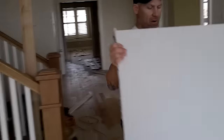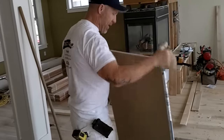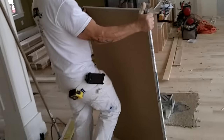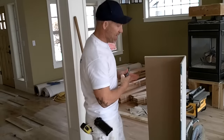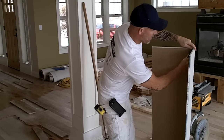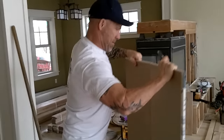Then you're just going to take that piece of drywall, move it around — I'm going to hold both sides and take my knee and put some pressure where that score was. Just hold it and it's going to snap the gypsum inside. Now I'm just going to take and cut the paper on the back side, and my drywall's been cut.